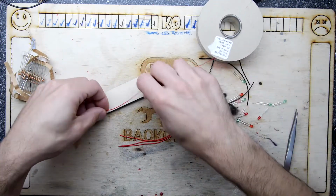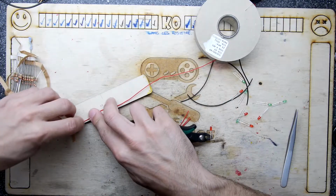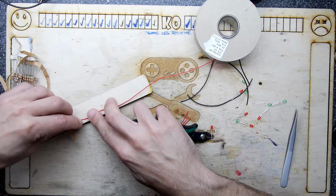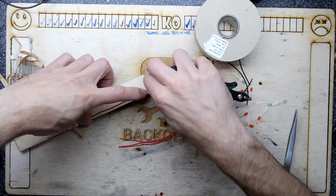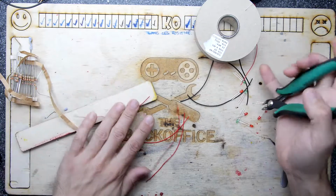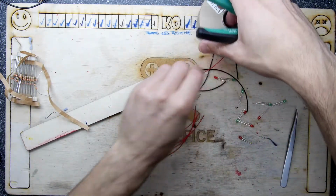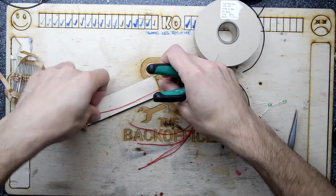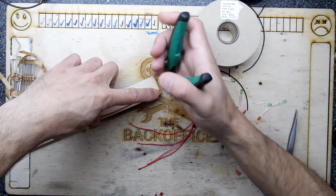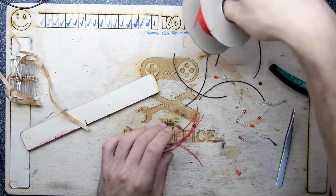And not only that, I've included on the hardware the option for a CAN bus transceiver, so all the pre-production units have that fitted, and it's marvelous actually. They can all talk to each other. It's like a genuine IoT device, and if you look up the specs for CAN bus, it's up to 1 kilometre on that bus, so it's really cool, and it's really easy to wire things together.